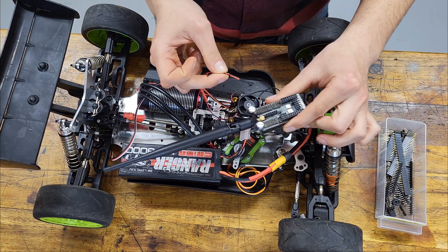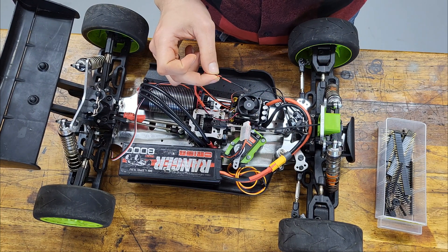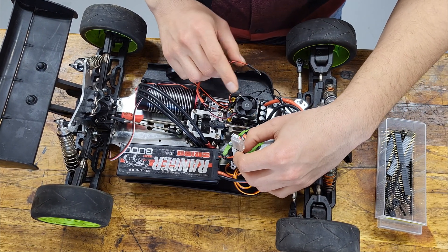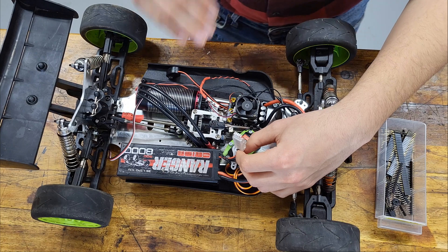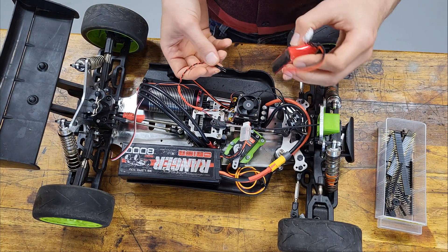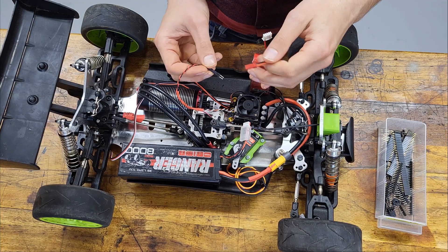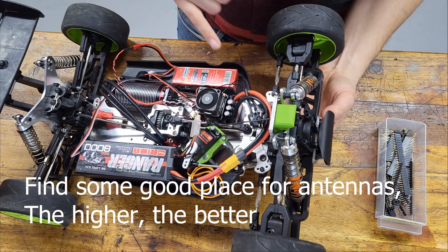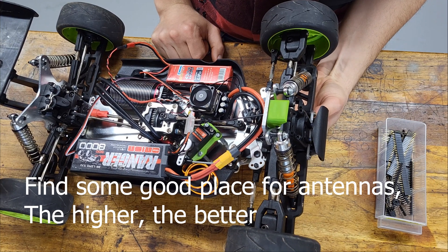The connector that I created is designed for this transceiver, which will later allow me to turn it on and off with the touch of a button on the steering wheel. You can use this connector directly from the battery — just make sure that voltages are matched with the components you are using. I'm going to test it with this battery. Fan starts spinning and the green light should turn on and we should have video.